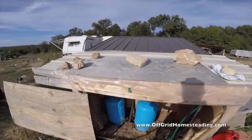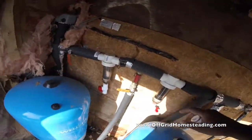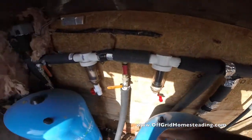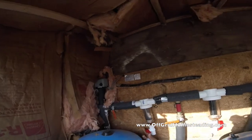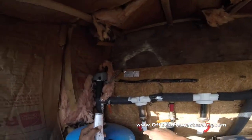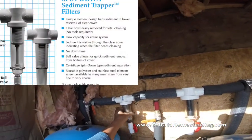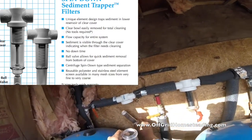First thing you do: turn off the water from the pressure tanks, from your main pump, and anywhere else, then simply release the water out of these areas. I have the very first filter right here — I usually use a smaller grain filter, so we're using a 200 mesh filter right here.